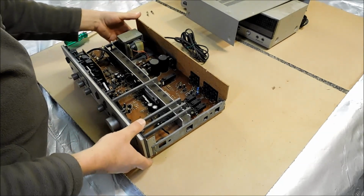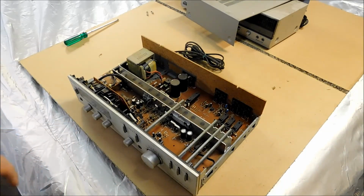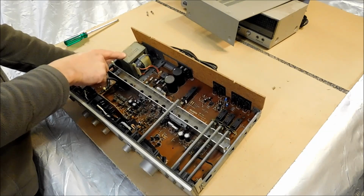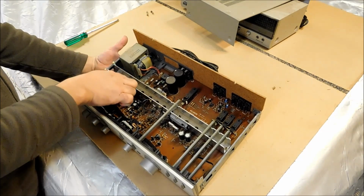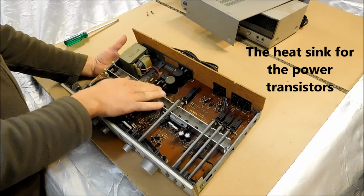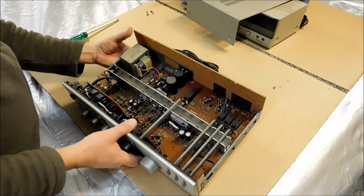Well, it doesn't look very tidy, but it's not too bad. Here we have a linear power supply. It's just a transformer. So your AC goes in and 12 volts, whatever, comes out of it. That aluminium strip in the centre with the transistors on it, that's the amplifier section. Transistors can either be electronic switches or amplifiers. We can go into that sort of thing later.